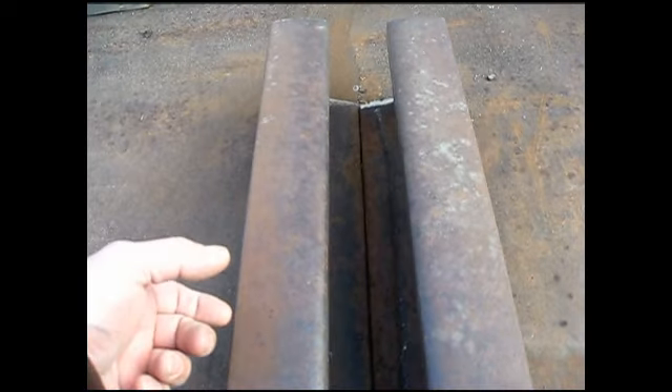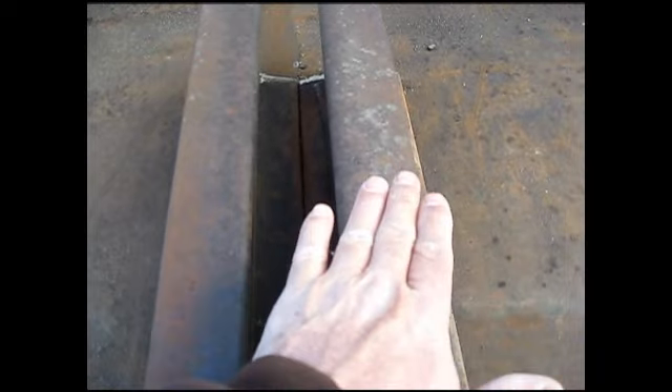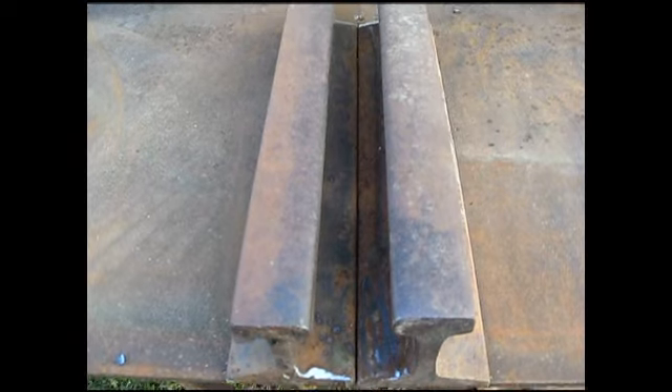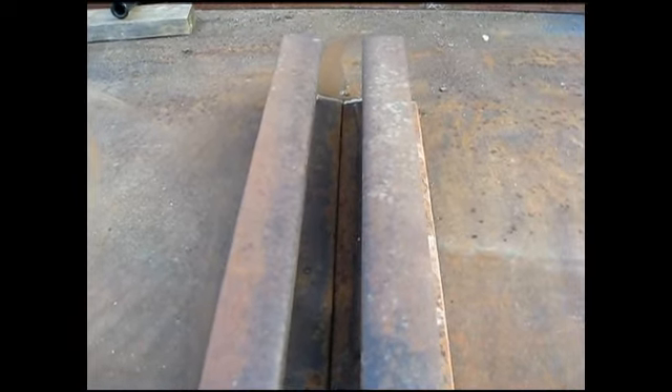I know what you're saying — I'm probably going to take the temper and everything out. Well, it's not really a big issue because there is a lot of radius there and I could always hard surface it. What I plan on doing is once I shape the horn, I'll also be getting some hard plate to put on top. I'll have a build-up surface, then it'll step at the horn and the horn will come out.